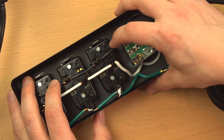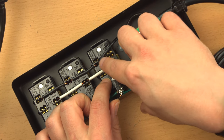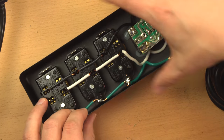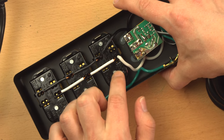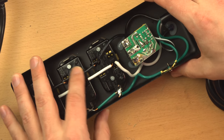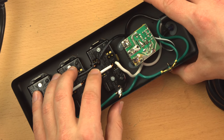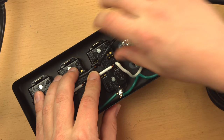These are stranded wires, so not suitable for use in these devices. Not only are they stranded wires, but they're also soldered, they're tinned. So they're not, strictly speaking, copper wires, which these require. The wire underneath the tinning is probably copper, although I haven't actually checked that for sure. But at any rate, it's not a copper-to-copper connection. You're basically putting in a lead and tin or whatever kind of solder they used wire into here.